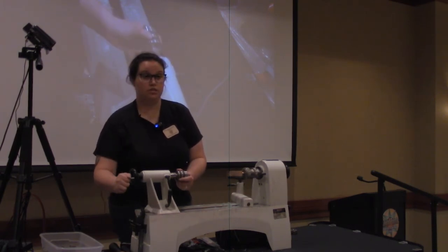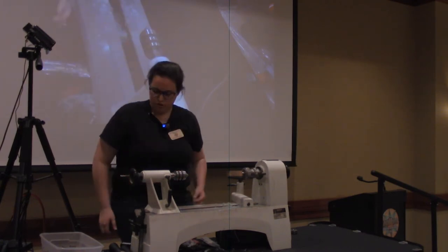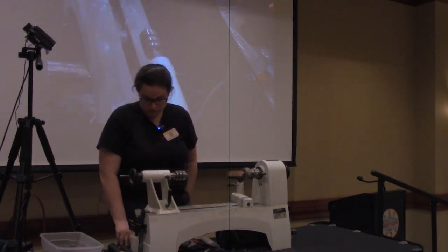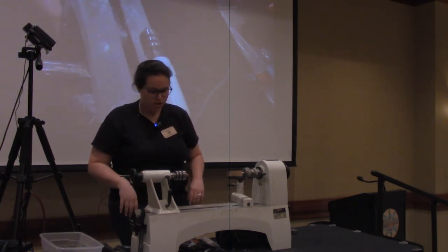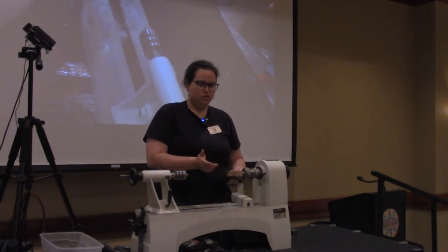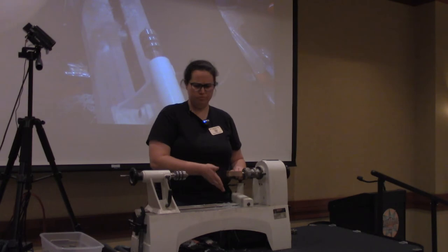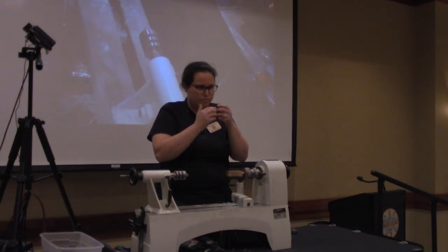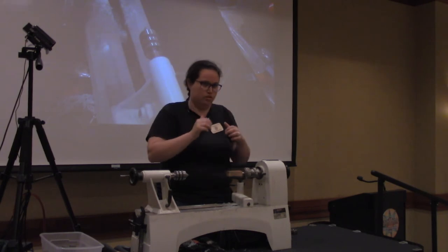Okay, on your body end, do you true the end up at all before gluing the hardware in? I do. Yeah, and that's actually a great question. Sometimes I get a little lazy and I just cut my blanks on the chop saw so that they're already kind of trued up. But all it really takes is once you drill your holes, just take a piece of sandpaper and just sand the end so that it's true. And then your hardware will fit flush. And just check your hardware. If you have a gap, sand it a little more. Then you're good. As long as you can't see that little gap in there, then you're fine.